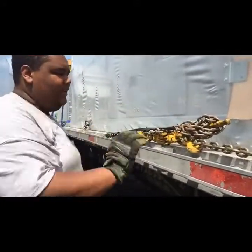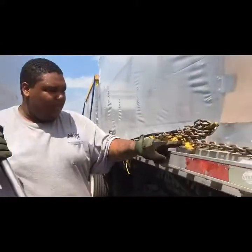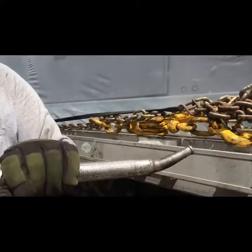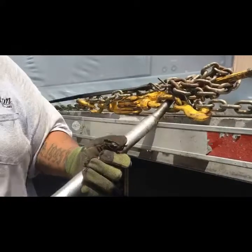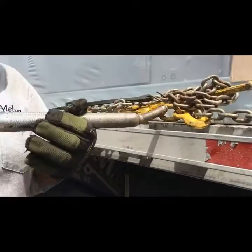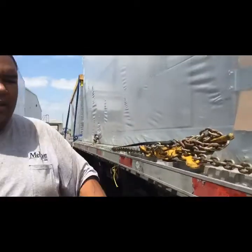In transit if the binder spins and you need to fix it, I'll show you a little trick. See this big U on the binder? Take the nipple end of your breaker bar, stick it in there, and you can twist these binders any way you need them to go while they're still bound. That's just a little tip and trick.